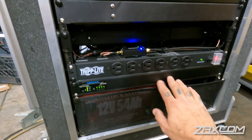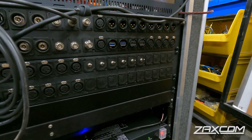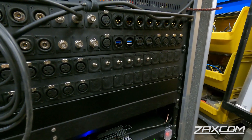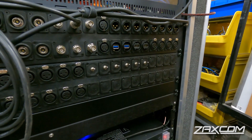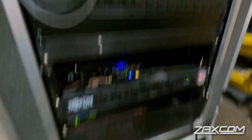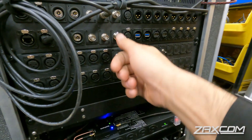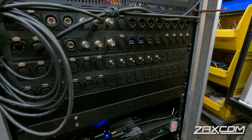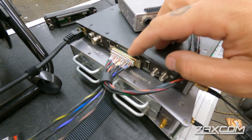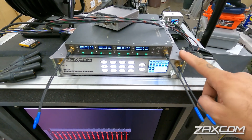The way I'm making Dante work with this cart is with a Sonifex AVN-AES-IO-8R. When this shows up in Dante Controller it is a 16 AES in and 16 AES out unit. On the front there's an RX12, and you'll notice a row of switches — each is a triple-pole double-throw. In the up position the Diva 24 gets its AES from the RX12; click them down and the AES signal comes from the Sonifex AES outputs. Switches up equals local receiver, switches down equals Dante device.